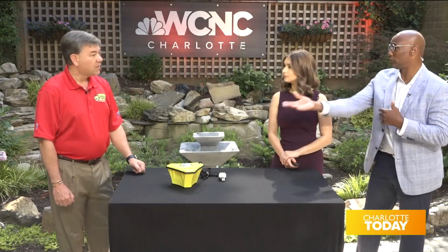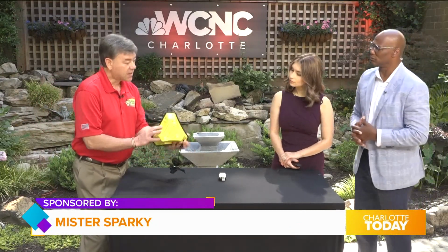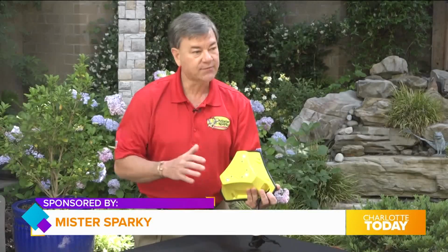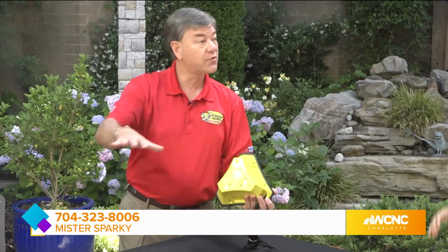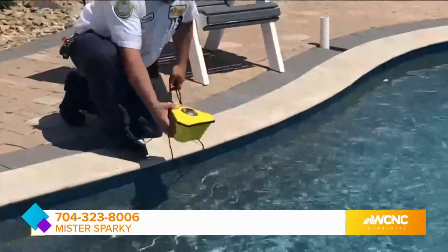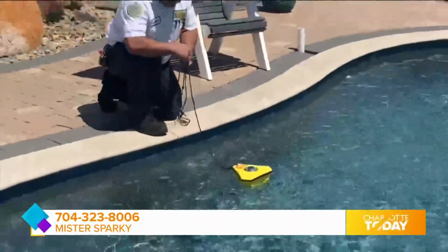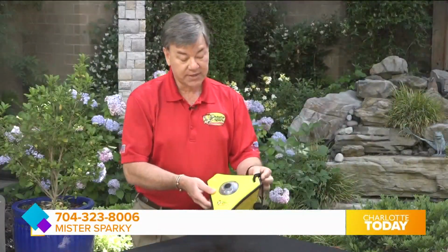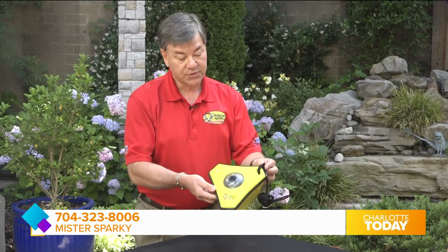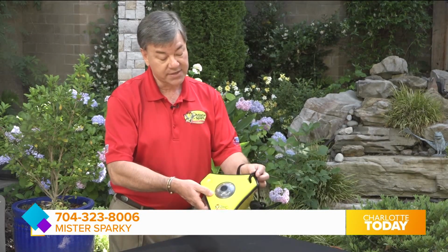So you mentioned some of the problems. How can we check these problems around the pool? Well, one item we use is this buoy. It's a shock alert tester. It's got little probes here that check for voltage in the water. This floats around on the water, and it checks to see if there are any voltages in the water. Voltages can come from the utility plants, your grounding in your pool, your dock, and that sort of thing. When you turn it on, it goes through a beep, and then it will show green, and if there's any voltage in the water, it will start beeping loud and show red here.